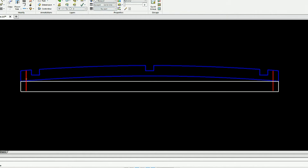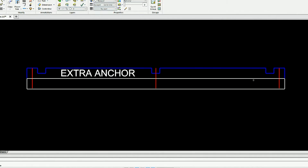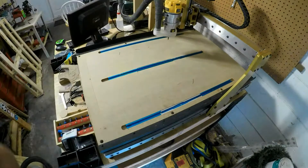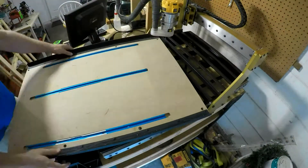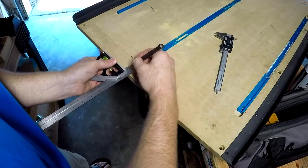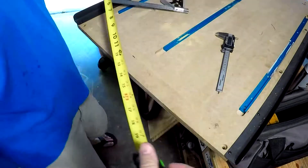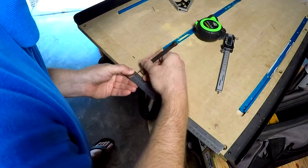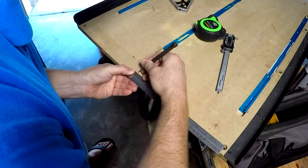The red lines shown here represent the screws that normally anchored the MDF base. I cut slots down nearly the entire length of the MDF tabletop, weakening it and encouraging separation. To remedy this, I installed another set of screws in the middle of the table. Perhaps it should have been there to begin with, but my modifications weren't really doing it any favors either. I knew there were electronics under at least one end, so all the more reason for caution.